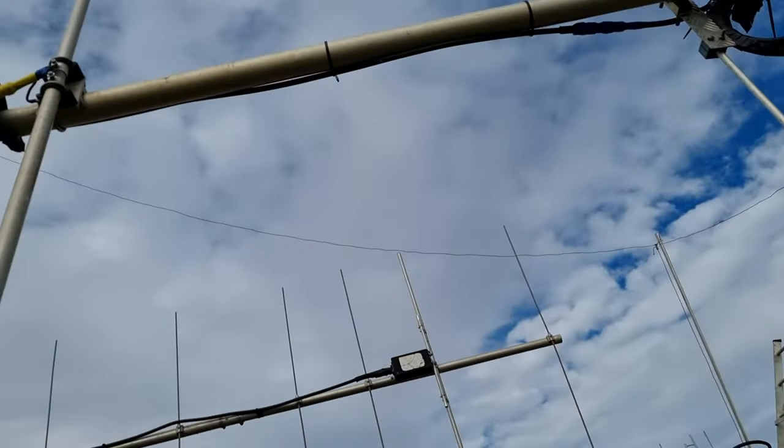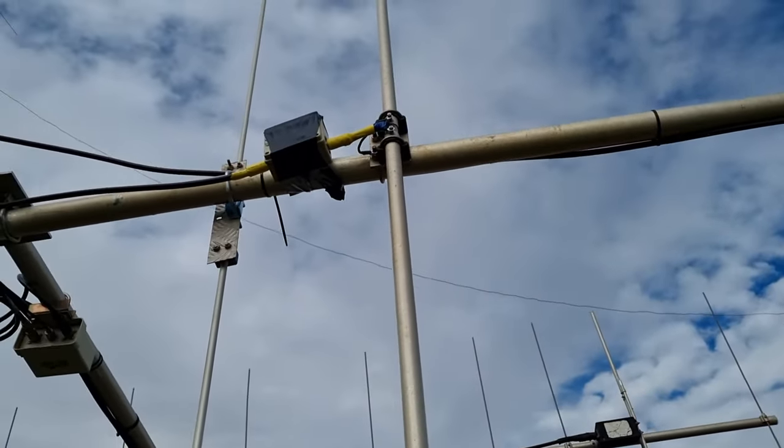This is the feed point for the T-34, which is actually about to be upgraded to a proper balun that I've got. When I took down my StepIR, I wanted to still have six metres and have it on a separate beam so I could actually leave - if I went out, I could still be receiving FT8 and have a good idea of what's happening on ten and six metres simultaneously. You can do that this way.